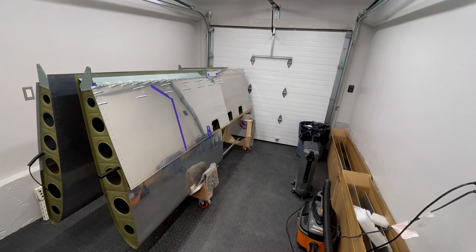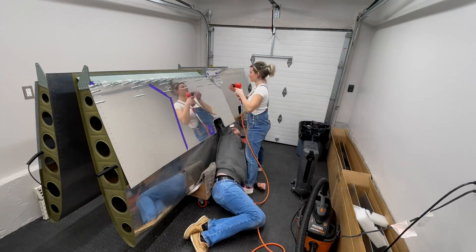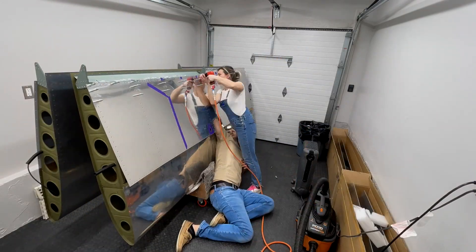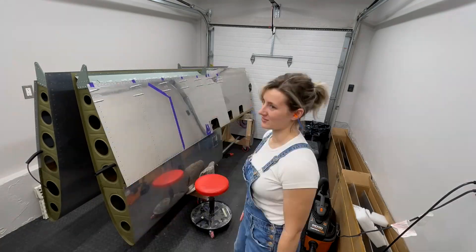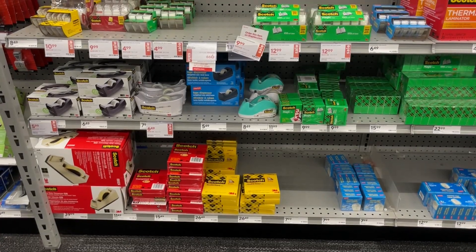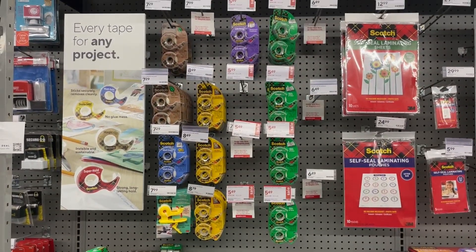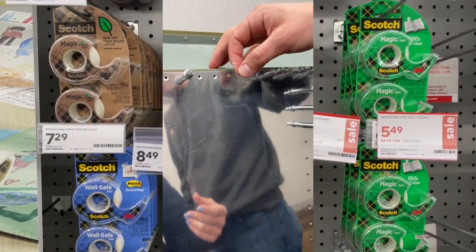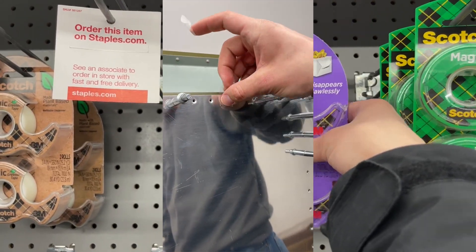As you can see in the shot, we have purple tape separating the outboard two bays. This is simply showing the reach that Cliff had through the lightning holes from the wingtip, so we knew we could finish riveting that forward spar without those done. I went to Staples on a mission to find the perfect rivet-back tape, but after testing a few different scotch tapes, they all removed exactly the same from aluminum — so it does not matter in the least.